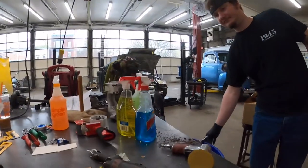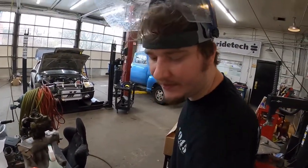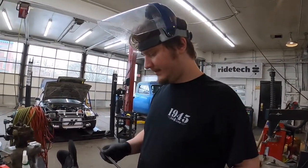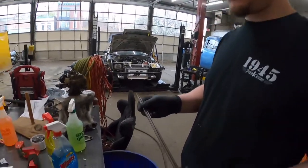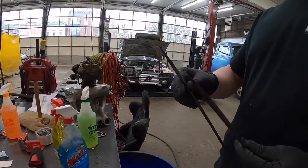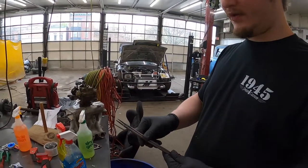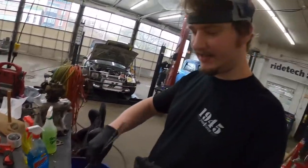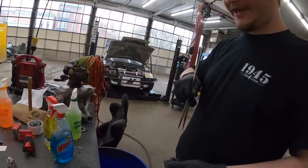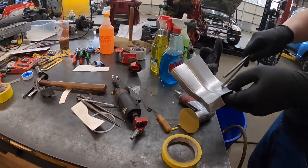So Jack, actually talk about what your chopsticks are for. It's not my idea — I saw somebody online who makes videos. He did a lot of work for Aston Martin. He said he makes a tucking tool by taking these quarter-inch rods, sharpening them almost to a point on the ends — tapered — and you weld them together and put a bend in it. Then you can use this as a lever to put your gathers on. In this case, I'm trying to make some shrinks in here.